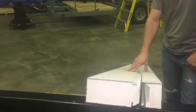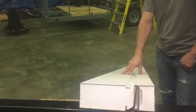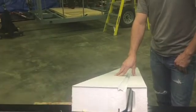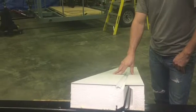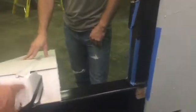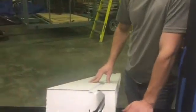The one we looked at yesterday, he said was 4.5, I think. And it's probably a better material than this. This is probably about the same as that. This one doesn't have the fire retardancy that the other one has. That in Thermosteel that gives it the gray is the fire retardant component that gives it that discoloration. But you've got the complete thermal break because you've got metal on one side, metal on the other, and it doesn't wrap around. Yeah, total thermal break.